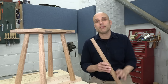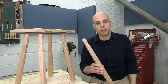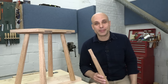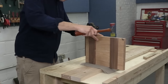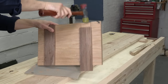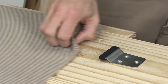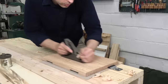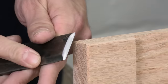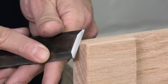You might have noticed that I actually made five leg blanks. I did that because I really thought I was going to screw one of them up — and I did. So make extra legs. Now I'm ready to assemble, but there's a key step that a lot of people miss: clean up. I'm going to knock everything apart and finish all my surfaces. The point is to avoid marking up the piece, so I'm padding everything, planing all my surfaces, chamfering all my edges, making my details crisp, and trimming off all my sharp corners. A stool like this is going to be handled a lot — it has to feel nice.